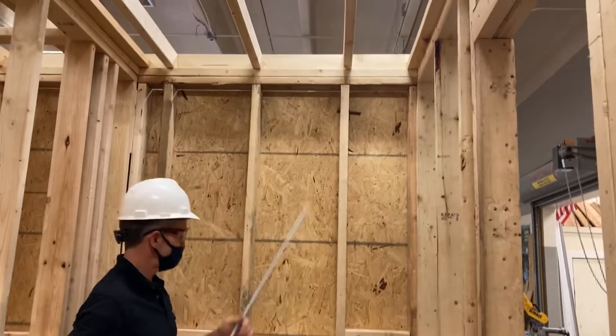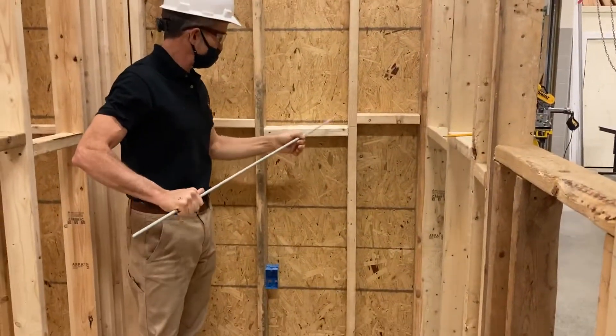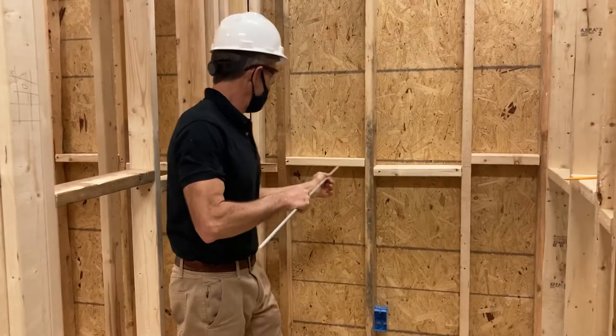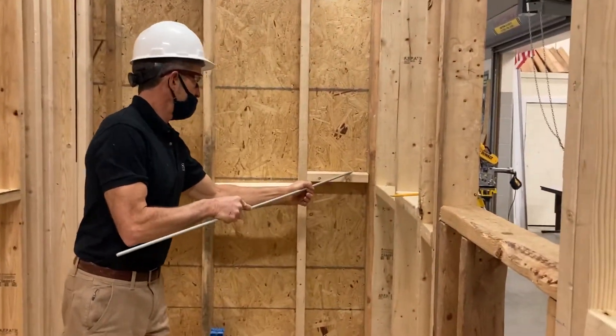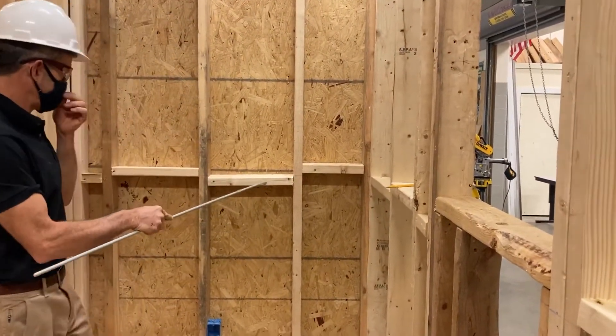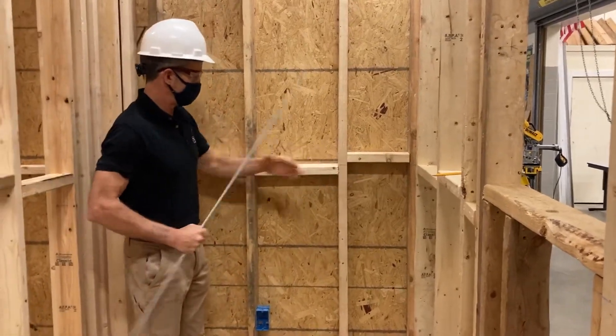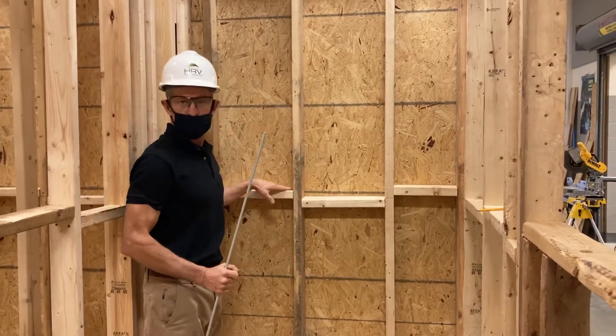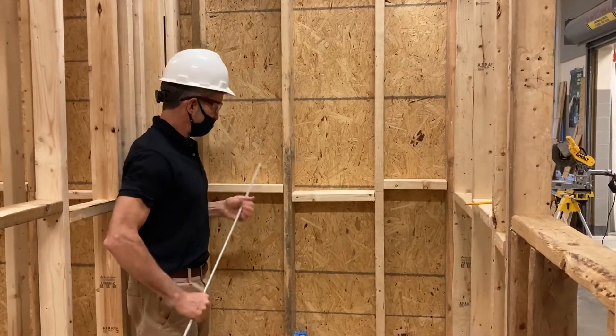This is an additional fire stop. If you notice how these fire stops are put in — we snap a line across, then put one block on one side of the line and one block on the other side of the line so that you can get good screws into it. Installing fire stopping may be one of the first jobs you get as a beginning carpenter.